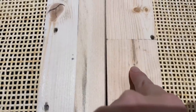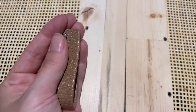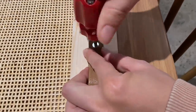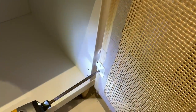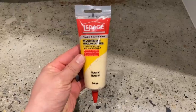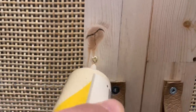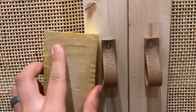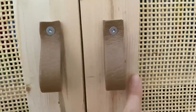I have measured and marked two spots where I'm going to now screw in my leather pulls. Just putting the doors on. This is the wood filler we picked up to fill the little handle holes — we just pushed it in there and smudged it down. We ended up repeating this process about four times, then used a little sander, sanded it, and here's how it looks. You almost can't see them at all, so I was very happy.